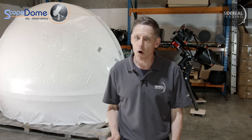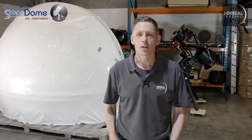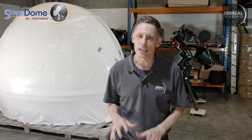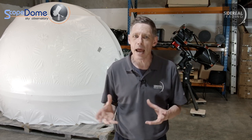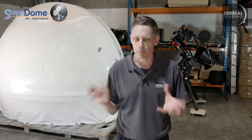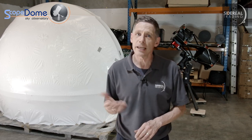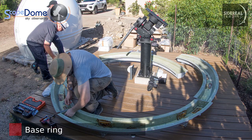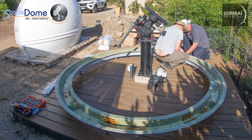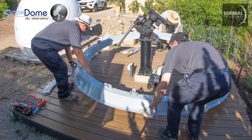Installing the base ring is the most complicated and time consuming part of the whole task. The ring consists of three parts: the base ring, which we construct upside down before sealing into exactly the right position; the rotating ring, which rotates with the dome and has the rack that engages the rotation motor - we sometimes call this the slip ring; and the outer ring cover, which is the bit you can see on the outside of the completed dome. We assemble the four equal sections of the base ring upside down with the rollers pointing down. They're bolted together and sealed with silicone, then we very carefully turn it right way up.